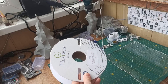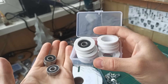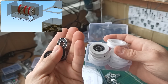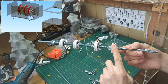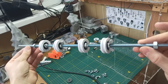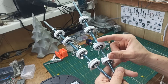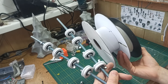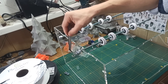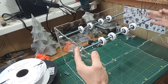Now we move to mounting the spool holder. For this we need two M8 threaded rods, 400 mm long, and a set of nuts or wing nuts, plus 3D-printed rollers on which our spool will ride. We press-fit 608 bearings into them. We thread our bearings with rollers onto each rod, fixing from both sides with wing nuts or regular nuts. A simple, straightforward construction. Quite convenient and comfortable to use. Thanks to this solution we can adjust the distance between rollers using the nuts, and accordingly adapt to the width of different spools. Our box has two holes for these rods. The rods are mounted both from inside and outside, directly to the wall of our box. The rods themselves serve not only as guides but also as connecting elements between the walls, adding strength and rigidity.